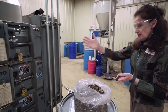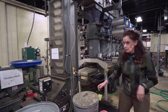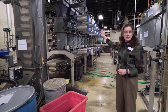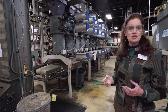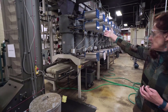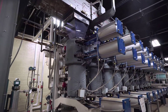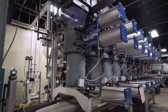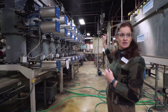Once that is done, they come out of the chopper and go into this next piece of equipment. Here we weigh the amount of roots, and they go up the bucket elevator into this PLC-controlled hot water inulin countercurrent extractor. This extracts the inulin — a high molecular weight polyfructose — which interferes with rubber extraction. The PLC is behind these tanks and controlled by computers. The plumbing allows up to 12 countercurrent extractions, with each pass making the inulin syrup more concentrated. The final syrup is pumped across the ceiling to a large stainless steel storage tank at the end of this processing plant.